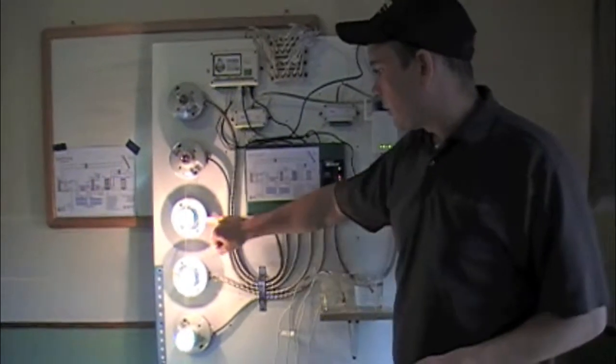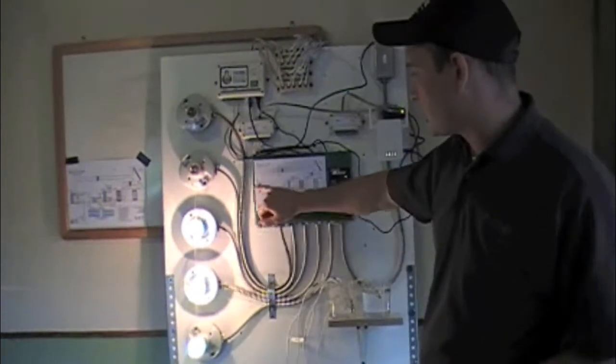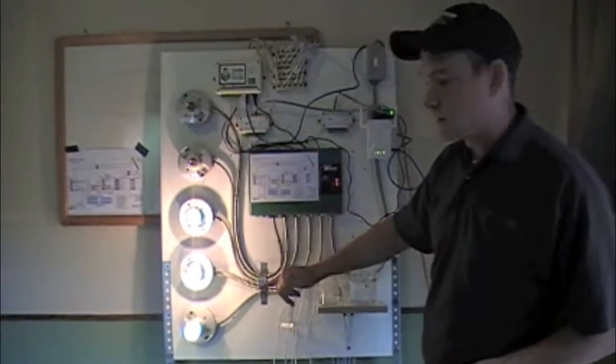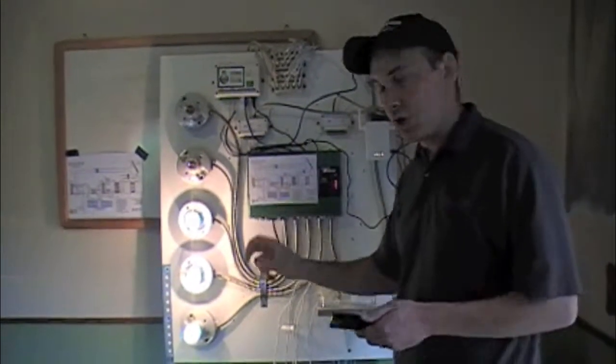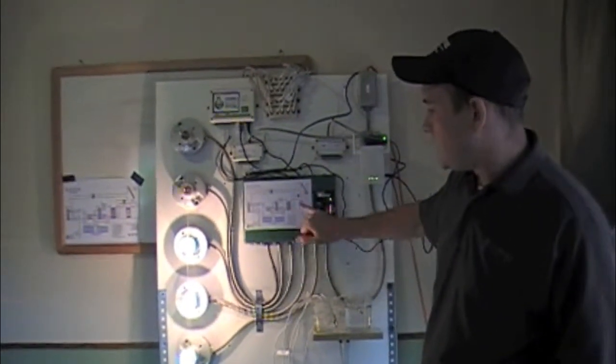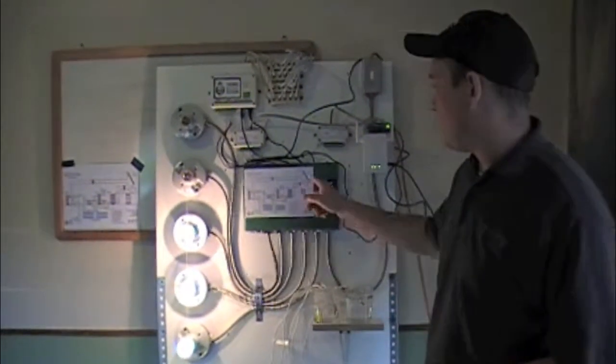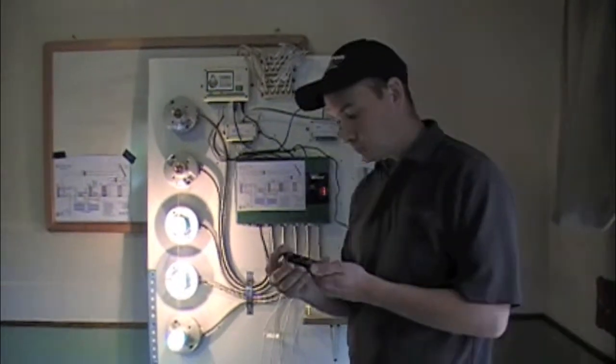And right now you can see we're running circuit C, so that would be our earth loop. That's running because the batteries in the transfer tank are below the set point, and so it's trickle charging the earth loop. That's why C is running. And then you can see circuit D and E are running. D is the domestic water preheat, and E is the primary solar loop.